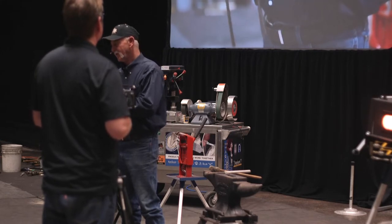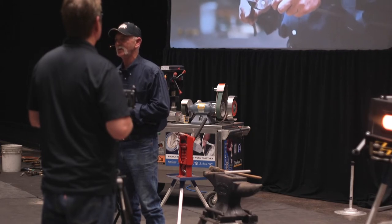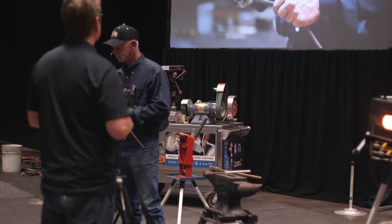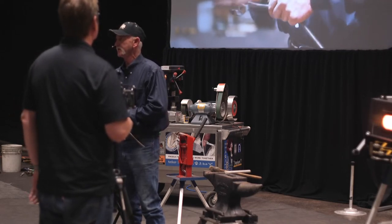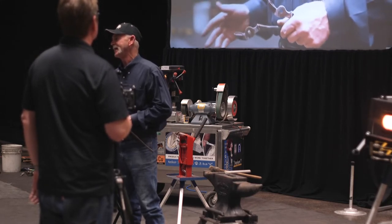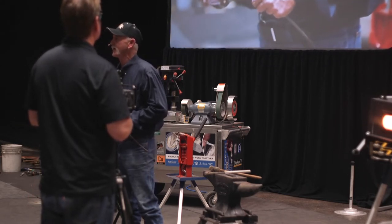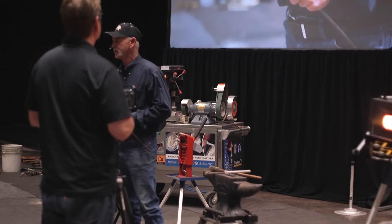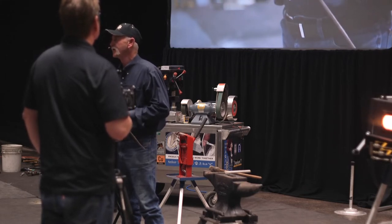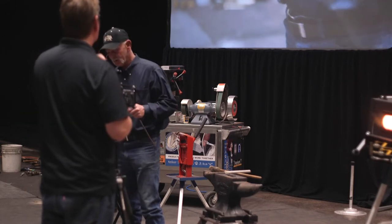The more flat on flat we have, the less it's going to hold. For instance, you've seen I used to make a square-headed pair of tongs and take a splitter and split cuts down it. Everybody's seen it, but Jay Sharp used to make a pair like that a lot. As far as I'm concerned, they stink for holding anything, because you've got to have the least amount of surface area possible to actually grab something. So the bigger the hole, the tighter they're going to grip, as long as they're flat on flat stock. So we'll get into that in a minute when I set them.